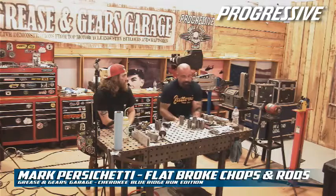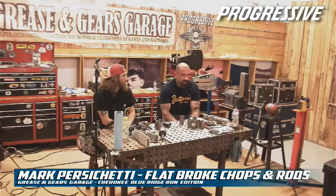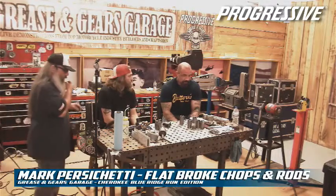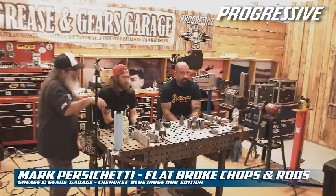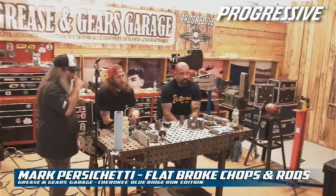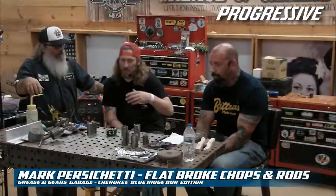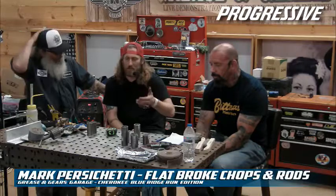Again, coming back to the food and pharmaceutical grade industry that I kind of came from, experience-wise, it's not sanitary either, where stainless work usually always is and should be. Also, purging with a certain amount of pressure allows the weld to not fall in as much. It kind of helps hold it out, so you get a smoother weld on the inside and outside.